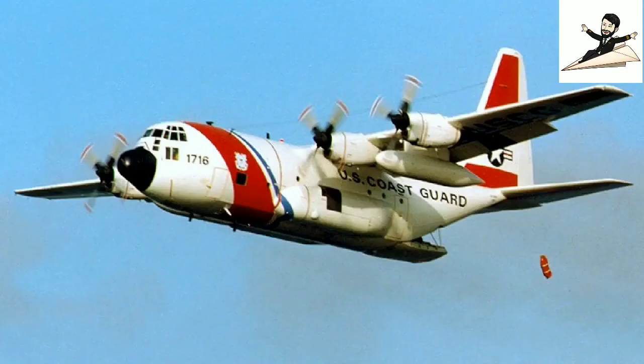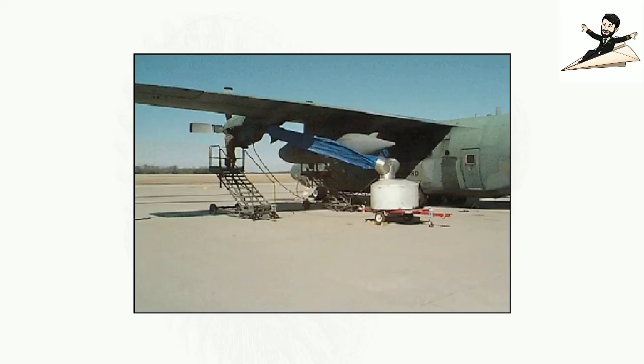If the major cause of contamination is salt ingestion, as might be the case with an aircraft which flies for long periods low over the sea, like this US Coast Guard C-130, then a timely rinsing of the compressor with fresh water can avoid the use of harsher treatment, which otherwise would be required. A compressor rinse can be carried out either while motoring the engine over on the starter, or while running the engine at idle speed. This procedure is known as a desalination wash.